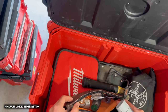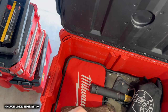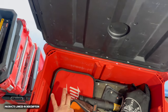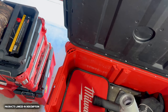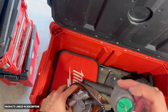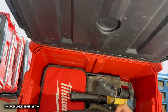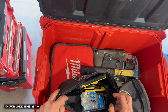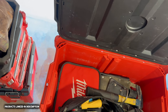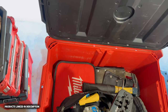This is for pulling jetline through conduit. These are little things — we call them rats or mouses — just different attachments so I can use a compressor or a vacuum to get jetline through. I kind of homemade some of these, but some are made by Greenlee. This is a low-voltage bag — we did some work for a school where we'd do auditoriums and run a lot of Cat5 and DMX.